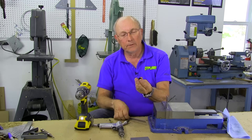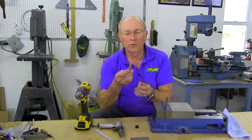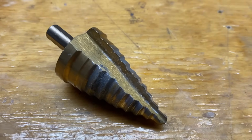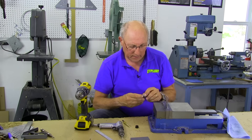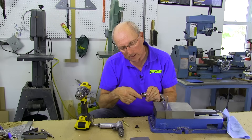So we're going to put in this plastic grommet, which if we measure it, comes out to 5/8 inch diameter. You've got two different sizes of step drills: the long, narrow, skinny one which goes up to about a half inch, and then the little bit wider, fatter ones which will go up to 7/8 of an inch. So if we go ahead and take a look at this and figure out the size we want — the numbers are kind of worn away on this particular one — I think that is 5/8 right there.